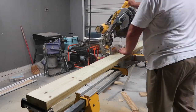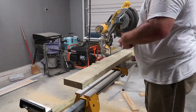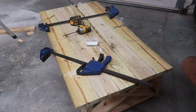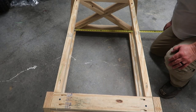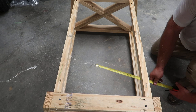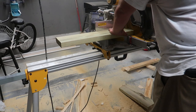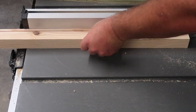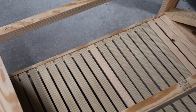For the top of the coffee table, I used two by six pine boards — five boards wide to give the desired width. For each side I added three inches of overhang to get the desired length. Once that was together, I used the Kreg pocket hole system and screwed all five boards together. For the bottom section I wanted the slat look, so I took measurements off the rebates of the lower portion cut out earlier so the slats would fit down nice and flush. I cut a two by six to length and then ripped them on the table saw to get the slats, which were about three eighths of an inch thick.